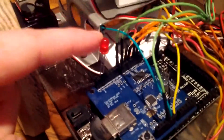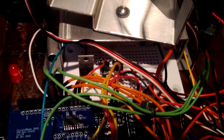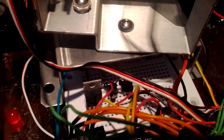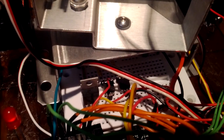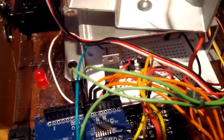In here I have a little light to indicate when the rangefinder is operating. There is a small breadboard underneath the gimbal where there is a 5-volt regulator on the far left to power the Arduino with a steady low-voltage power supply, and two MOSFETs I pulled out of an old electronic speed controller. One of which controls the 102-decibel siren mounted on top of this servo.